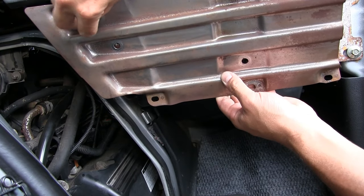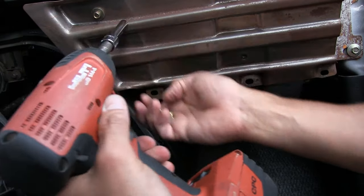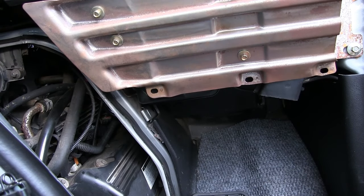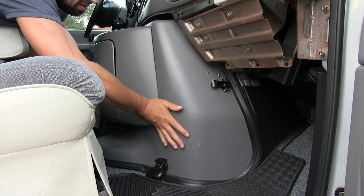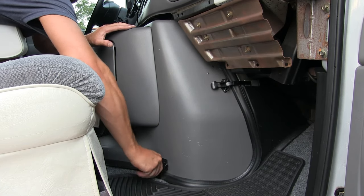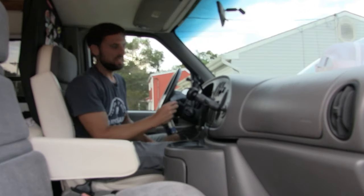That was the 8mm bolt. Tighten it with your fingers first before you put a wrench on it. Now we just have to slide the doghouse back on and put on the panel. Sometimes this part can be the most challenging — get everything lined up, line up the bottom first, line up the pins, and snap it in place. Now you can test the system to make sure it's working properly.